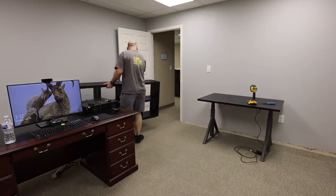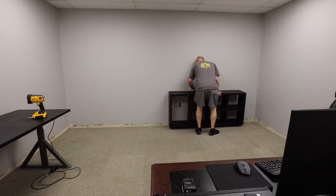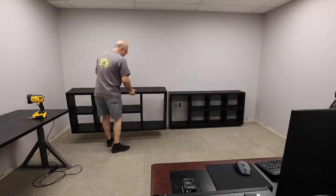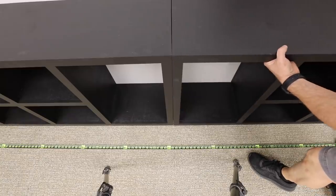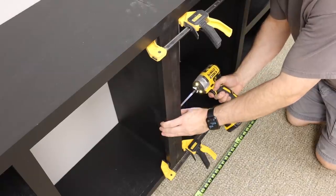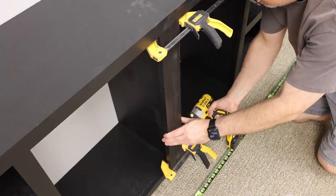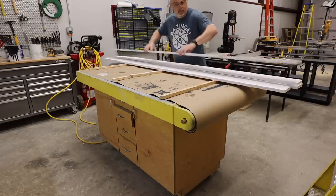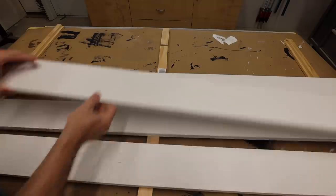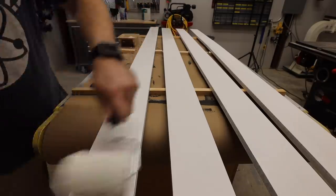With the paint dry, it's time to start installing it in the new studio room. I built the credenza in two separate pieces to make moving and installing it simpler, so once in the room I needed to join them together permanently. With the credenza in place, I went to work on the new baseboards. I decided to put a couple of coats of paint on them before installing them — this means I only have to paint the nail holes and joints after installing, which means a lot less time on my old man knees.